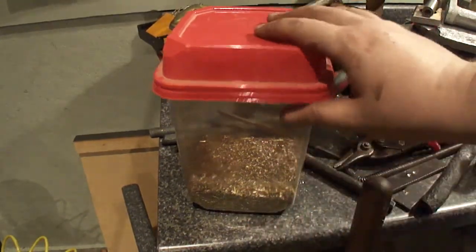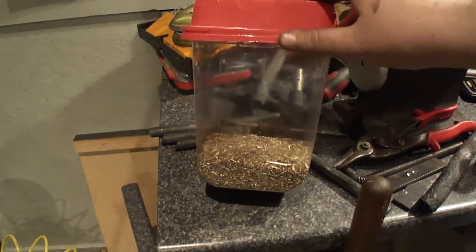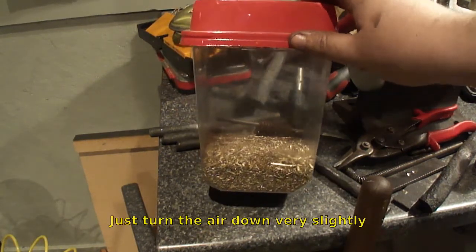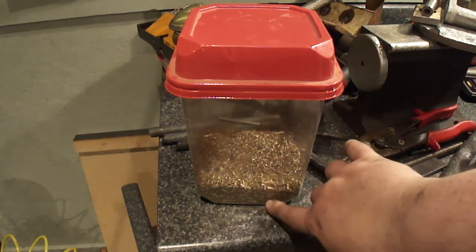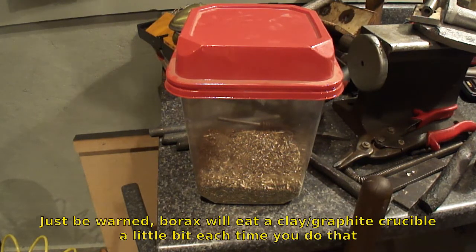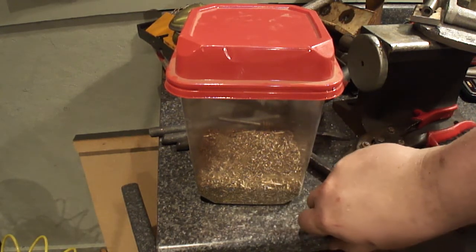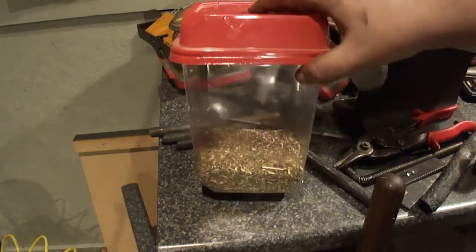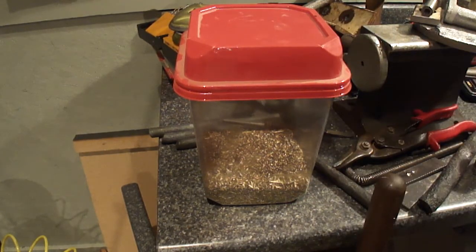I've had a lot of questions about remelting brass and bronze shavings. I usually just run my furnace a little bit rich — which means excess fuel, not hard to do with an oil burner. Before I put it in the furnace, I mix a bunch of borax with it. When the borax starts melting, before the metal starts melting, the borax acts as a barrier for oxygen, so you won't lose very much material — maybe just a tiny amount. Now aluminum, on the other hand — just vacuum it up, it's not worth it. It oxidizes faster than anything and there's no way to prevent it. But brass and bronze, that's what I do, and it's always worked great for me.